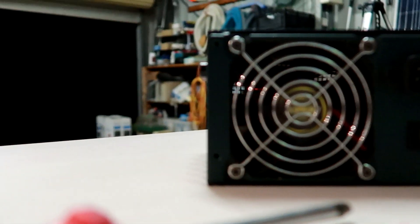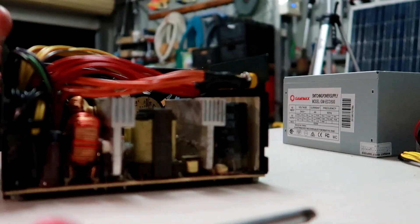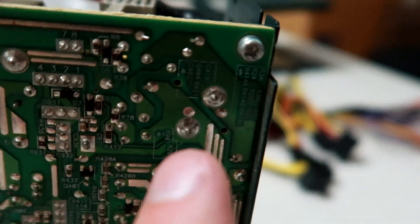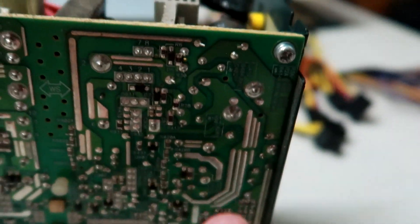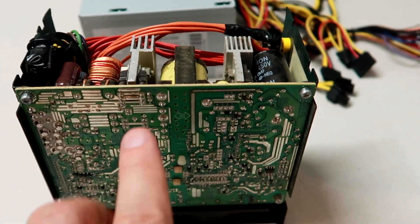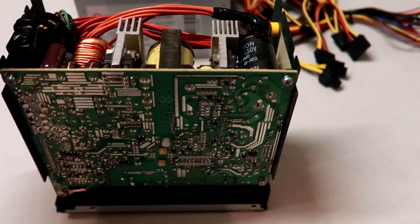Be very, very careful what you are doing. If you don't know exactly what you are doing, just watch some of the videos down below — they give you a step-by-step procedure. I have removed the screws already from the power supply. Have a look at this — that's all what's inside. And here I cannot stress enough: look at this bad boy here. This is a 450 volt DC capacitor. If you touch some of these bigger terminals where this capacitor is soldered to the mainboard, this can kill you. That's 450 volt DC. So be super, super careful with these devices. Don't touch anything on the underside. Put this on a plastic or wooden surface.